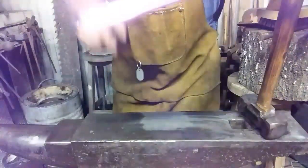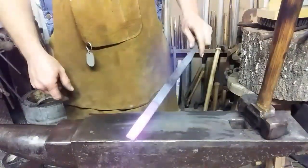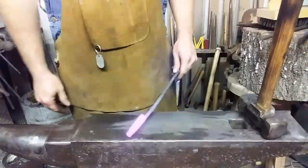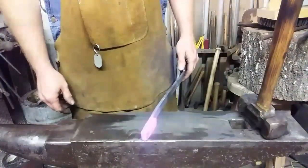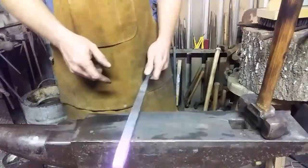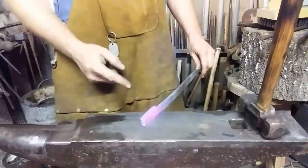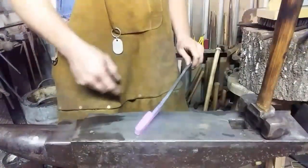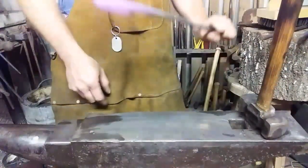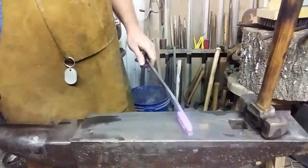Sticking pretty good. There's one little spot here towards the end that didn't quite stick like I wanted. I'm going to heat it up and try to forge it down the opposite direction and see how bad it splits. If it sticks about a half an inch in, I'll cut that part off because I want a nice sharp edge there. I made this piece long enough to where I can cut the tip flat and cut the inside like I wanted — basically a square block on a flat rod, rectangular is what I'm going for.